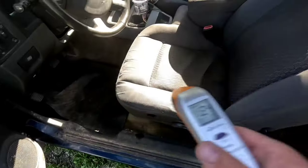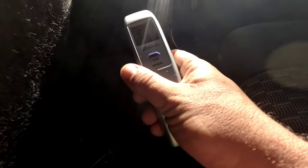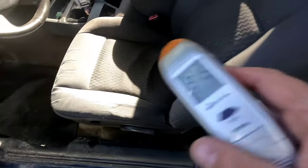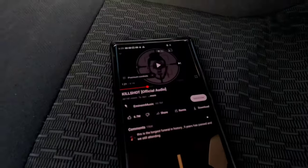When I really noticed it was when I drove for about 45 minutes and grazed it with my finger — I could tell it was very very hot. What we're going to do is take a pretty long ride and beat on it for about a half hour to 40 minutes, then take an actual reading from the Actron in real time and see how hot it actually gets. Sitting on the seat right now it's already at about 91 degrees, and this was obviously a hotter day than the other time. About 15 minutes in with 'Kill Shot' going — what I've been using to test it — it was at about 140.